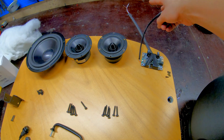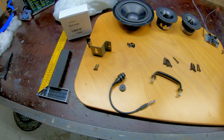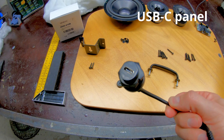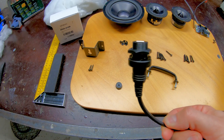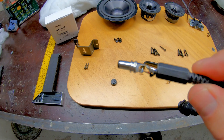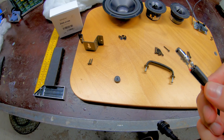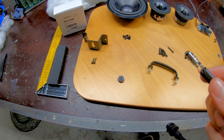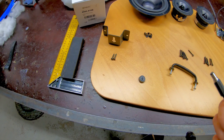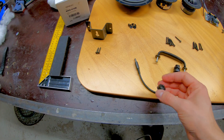We're going to have the speaker wires come out — it's a stereo amp — and then we're going to have the power going in. This is a USB-C panel mount cable from eBay, and to the other end I've soldered a 6mm DC plug. The red wire goes to the center and the black wire goes to the shell, and it even has a cap for some weather proofing.